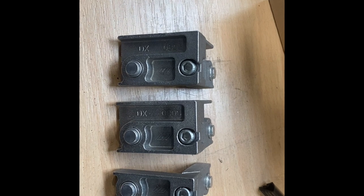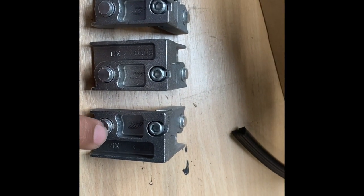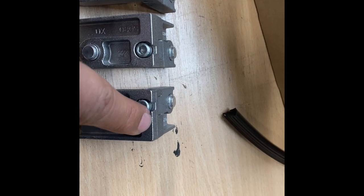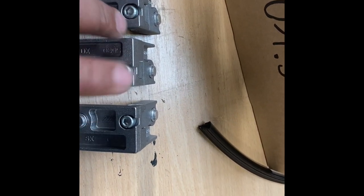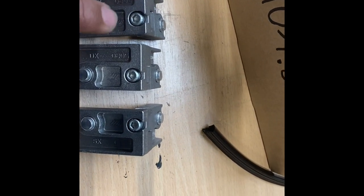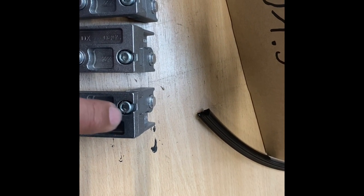So when it's a sliding profile, we are using this cleat. It may be right there as a DX or an SX. SX is normally used in the pivot side, in the pivot profile. But that particular SX has this part ground off. If you get an SX like that, which is exactly the same as a DX, it's not a problem, because you could use either of these or both in the sliding profile. But you can't use an SX which has this part ground off because that particular one is only used for a pivot door on the pivot side.